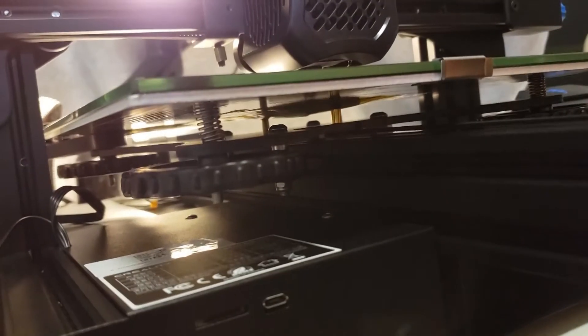There are a couple of things that weren't really clear when I was building the printer. For leveling the bed, there are four springs on each corner. The far left one — I thought there wasn't a spring because it was wound up all the way to the top and I thought it was just a plastic piece. Turns out there is a spring inside. Another point: you have to feel resistance when moving the paper under the nozzle — that's when you get better contact with the bed. If you're moving the paper and can't feel anything, the nozzle is way too high and you need to lower it or raise the bed.